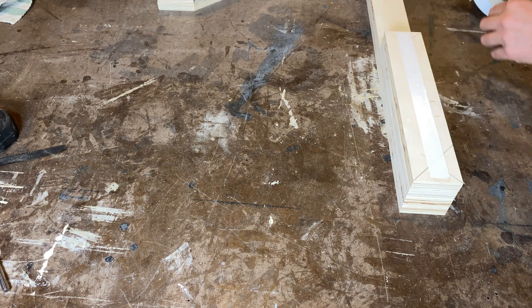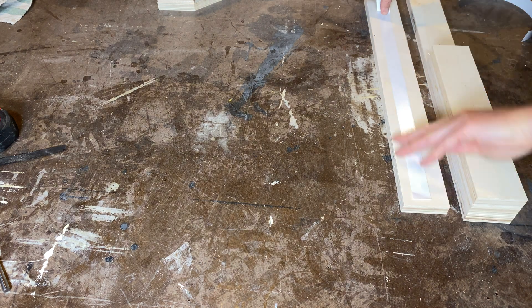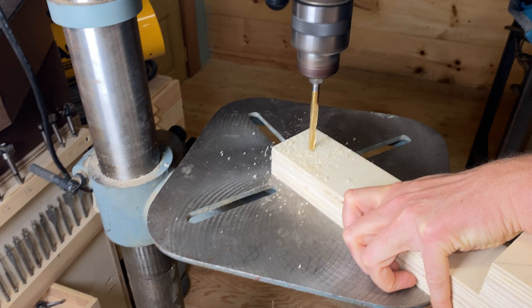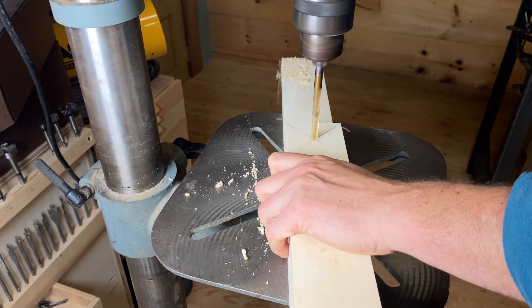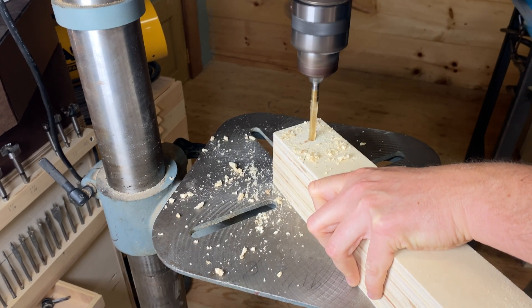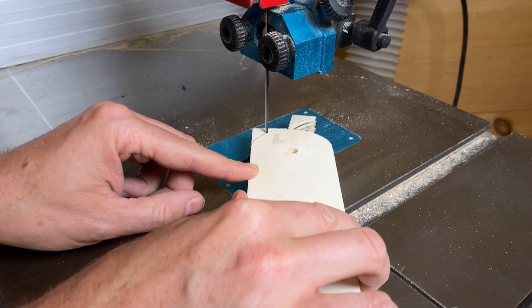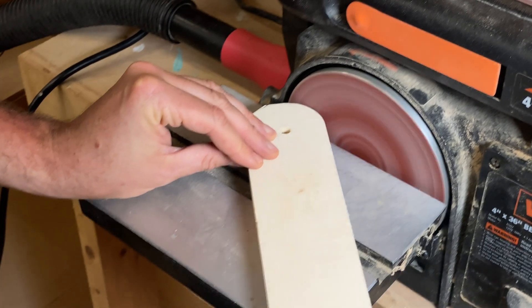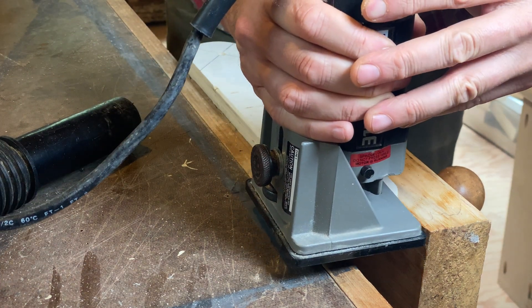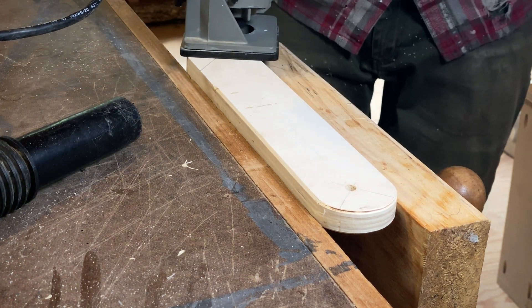Back to the arms — I'm using double-sided tape to stack them all together, both the short top arms and the long bottom arms, and then drilling the holes through all of them together. It doesn't really matter where the holes are; the only thing that matters is that they are the same distance from each other, so this guarantees that. Then I'm putting a little chamfer around these arms — not a round-over — so they don't get caught on the rest of the apparatus as it moves up and down, and they'll feel and look a little nicer.